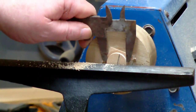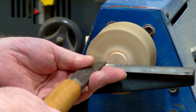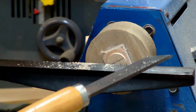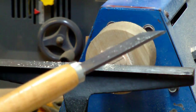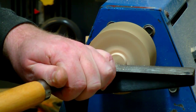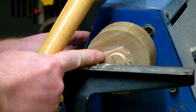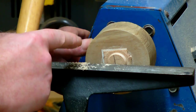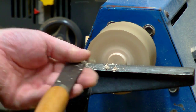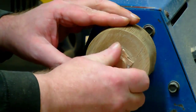I'm checking for the diameter — it's still a little too large. Checking again — there we are. Now I chamfer the bottom. With the bottom chamfered, it's time to pop it off the rest, because I left some material on here for a better grip with the double stick tape. Then I just peel this off.